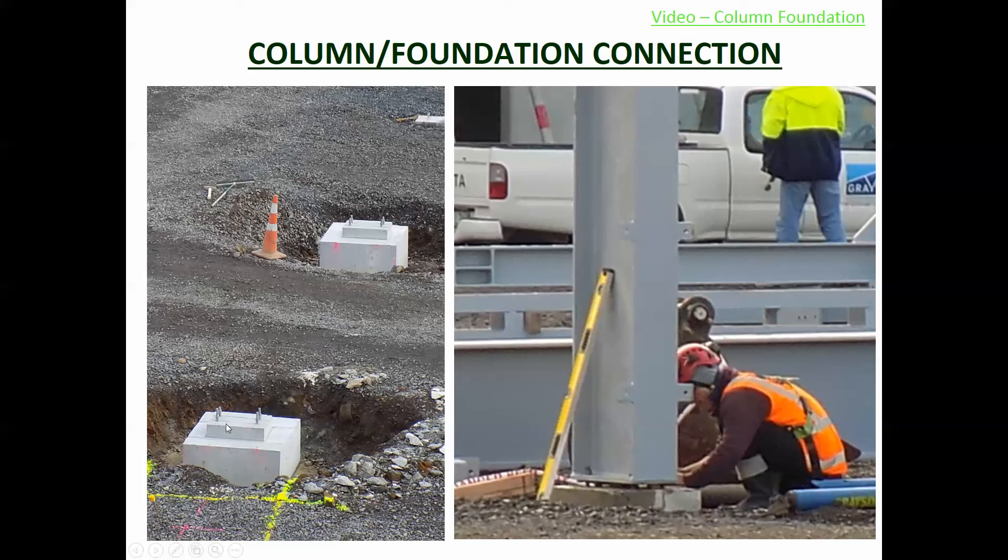You'll notice there's a little gap here. Sometimes you'll have the bolts coming out, connecting onto the steel plate, and there'll be a gap there. What you do is fill that gap with dry-mix concrete — dry-mix concrete is like cement and sand with a little bit of water; it looks like wet sand. You ram it in underneath, and when it sets it creates a solid concrete joint.